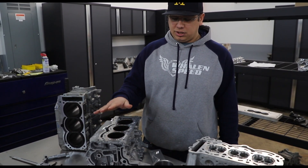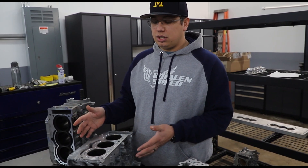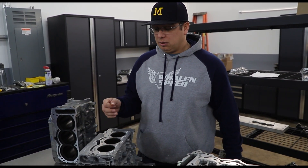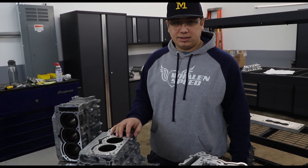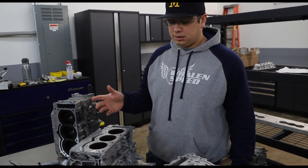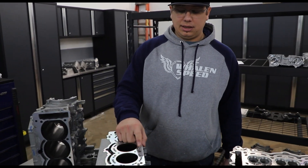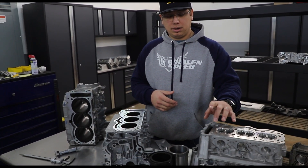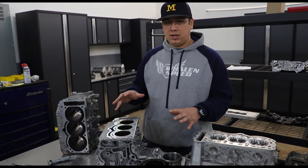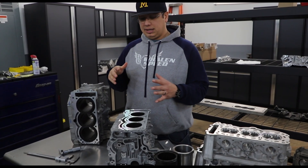This block is going to be our new V2. The V1 will be a basic rebuild with a piston upgrade. The V2 will have the same engine internals as they currently are, with the sleeve, and we're going to run the custom-made A625 9mm head studs. We've had great luck running quite a bit of boost with that stud without needing bigger head studs, which makes head gasket installs easier and avoids having to machine the cylinder head for a bigger stud.